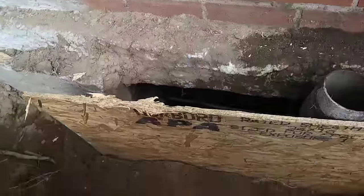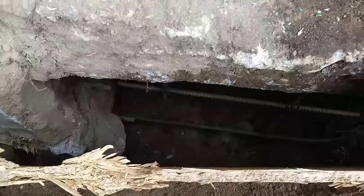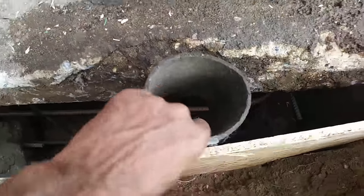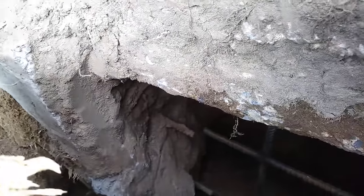The little pipe here is holding our form out. What we do is we've dug down 36 inches below grade and we're going to fill all of this area with solid concrete. That'll go all the way under to about 18 inches across and come all the way up to the bottom of the existing shallow footer. Frankly, I can't believe this thing hasn't settled more. On this particular portion we're turning a corner.